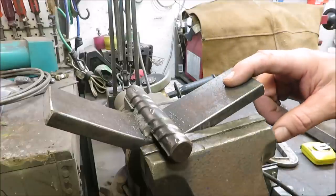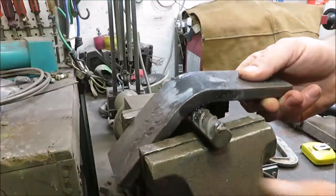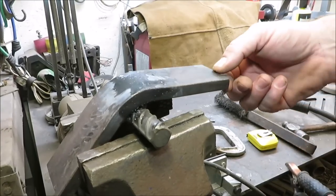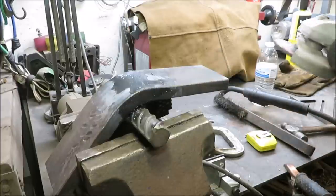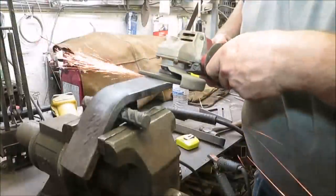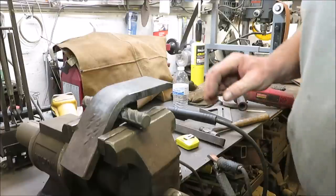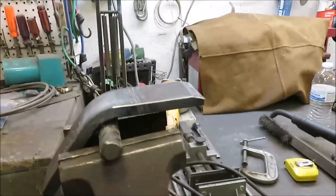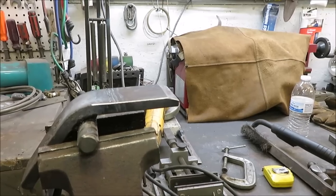What we're going to do now is this is the piece that's going to go underneath our wood. So I'm going to flip this over and put a little bit of a taper on this edge so we can get it down in between the boards. I'm just going to use a four-inch grinder and grind it down until we get a little bit of a taper on it. We got a little bit of a taper on there - not much, but I think it'll be fine to get it down between the wood. I think that's going to work out just fine.